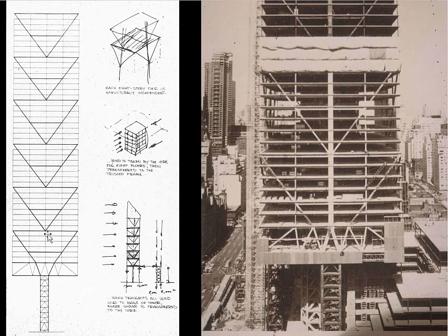These trusses are designed with a sort of K bracing. If you put your head to the side, you can see this looks like a K right here. Those elements combined with those elements form a K. They are converging at the center, so loads are being pulled down that face to this huge column at the boundary. This is a very dramatic example of what you can do with some imagination.